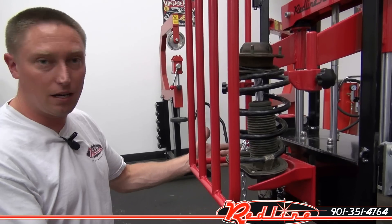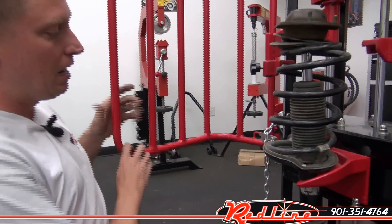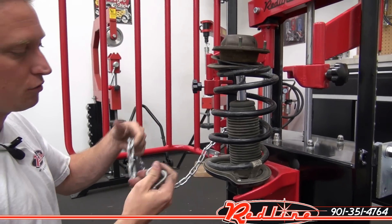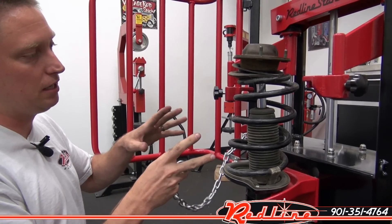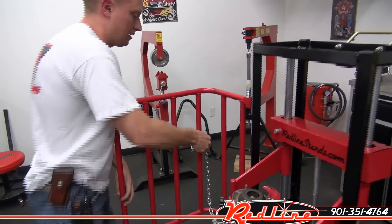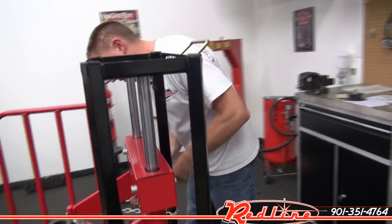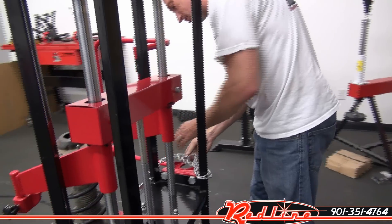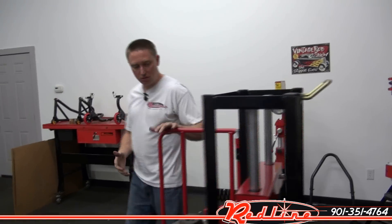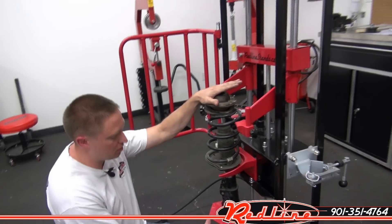To open this back up, I'll pick the little lock back up. I like to take the chain — this is actually a safety chain that I'll show you in just a minute that keeps the spring from coming out. I like to wrap it back around the back of the spring compressor and hook it onto itself, so I'm not dealing with the door closing on me while I'm trying to work on my spring.